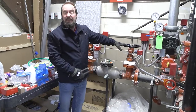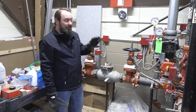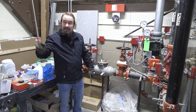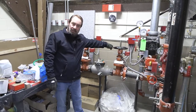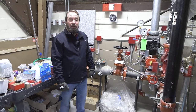You'll possibly get an alarm at the panel, but at that point it doesn't matter because you have water flowing. If you don't know what it is, never shut the valves until the fire department gets here — only if you know. If you physically see somebody hit a sprinkler head and you know it's not a fire, shut it. The fire department may say no, but it saves material loss.